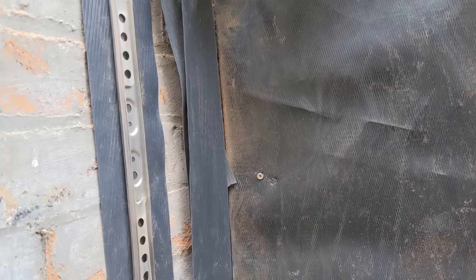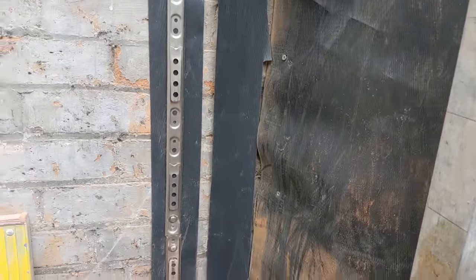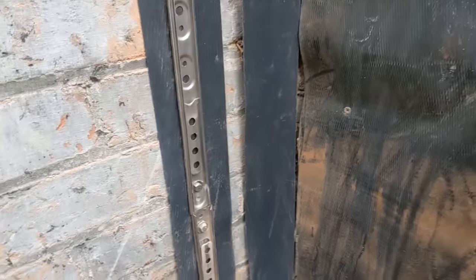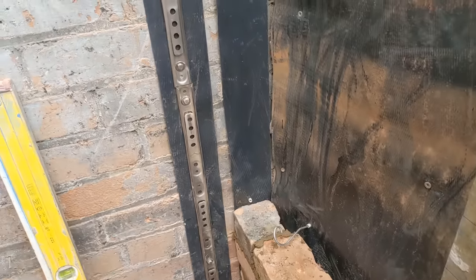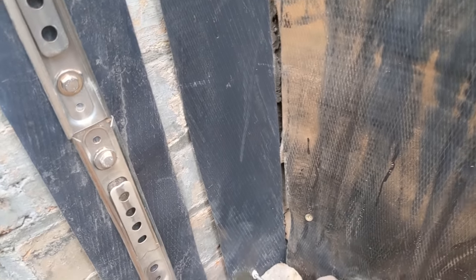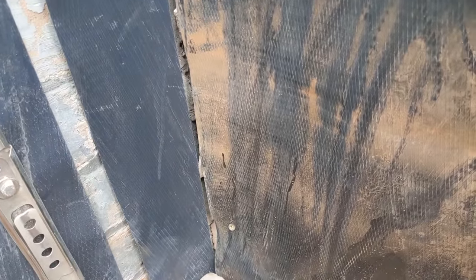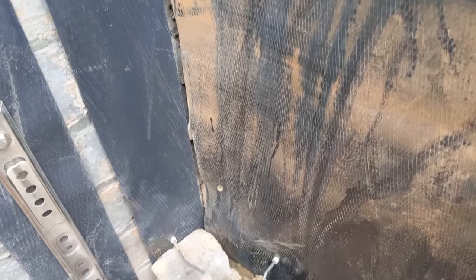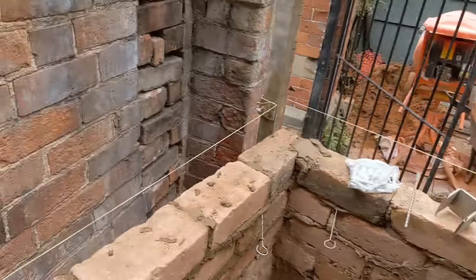Little update: I've put the tanking DPC up this wall. The wall is slowly coming away so I'm getting rid of the cuts — before I had a little triangle pistol cut in this corner. I've also run some DPC up the wall. We are screw-tying pretty much every two courses — as many ties as we can get in there. So the plan of attack is to blast this up and blast that up.